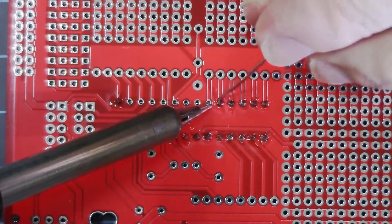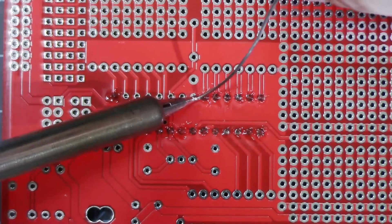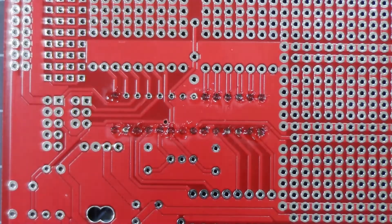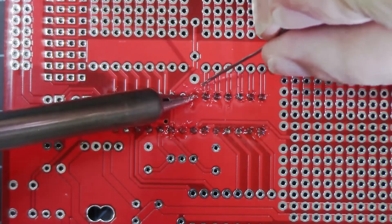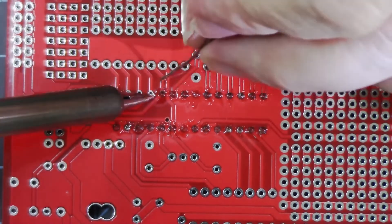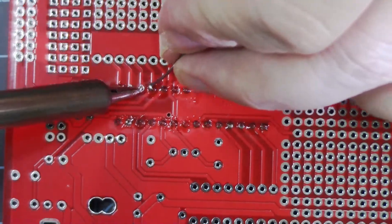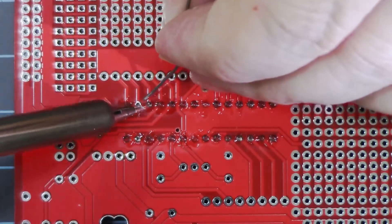As you can see, the Lohner 971E had no problem soldering these simple through-hole joints and there was zero recovery time throughout this board build, despite all of its connection points being plated through holes, which can sometimes require more power to solder than a simple pad solder point might. The iron feels very comfortable in my hand and even after using the Lohner 971E for a couple of months now, I have yet to experience any hand fatigue.